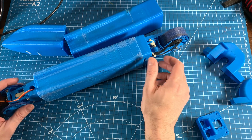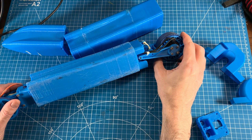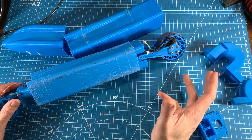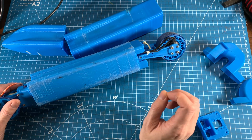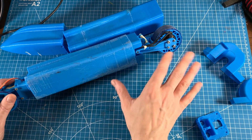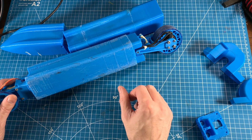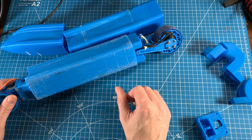This is just something that happens with brushless, sensorless motors, is that it has to generate enough back EMF, essentially enough load, to be able to measure the position of the different phases of the motor, which means essentially it has a minimum speed that it's going to be able to spin. And as you can see, as soon as you just hit that minimum speed, it blows the tire off the rear. Obviously, the motor is more than strong enough to move the car from a standstill, which is a concern I had. A lot of people were telling me that I would need like a 300 or a 400 kV motor to be able to do a hub motor, and that's definitely not the case at all.